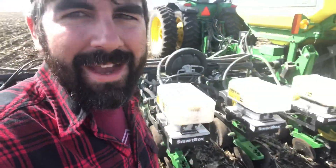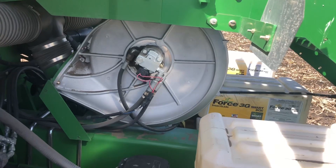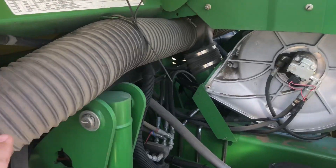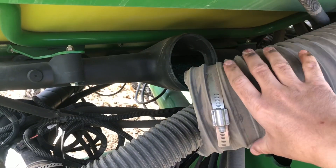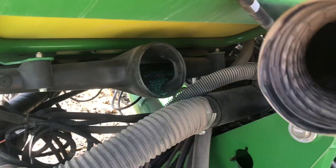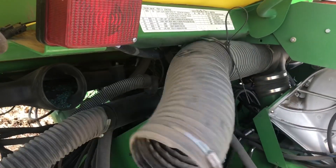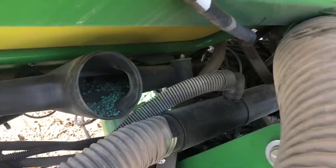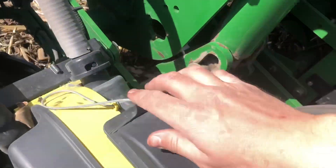This is almost kind of funny - it's so obvious what's wrong when you get around the backside of the planter here. This big blower right here, whenever the planter is down and you have the hydraulic down pressure engaged, this blower is running, forcing air through the ductwork to blow seed out to the mini hoppers. But look at this - the duct came disconnected. This was flopping around like one of those crazy inflatable salesmen guys in front of car dealerships, just flopping its arm like crazy, blowing air everywhere. As you can see, there's seed waiting to get pushed out to the mini hoppers. I'm guessing every one of these by now is probably empty.